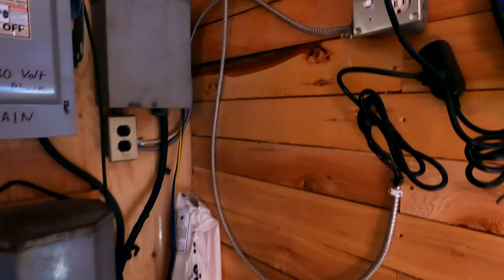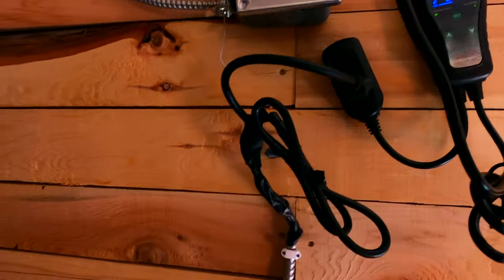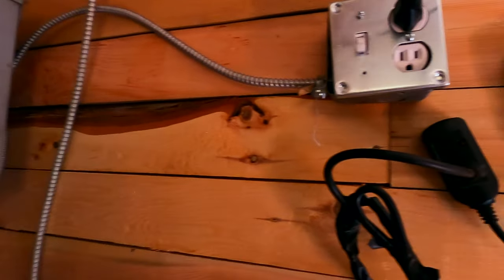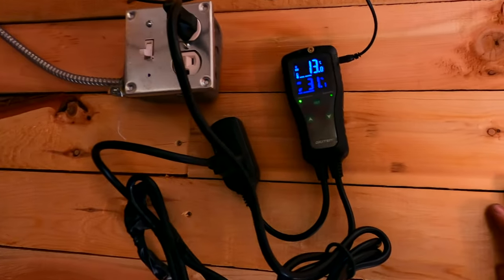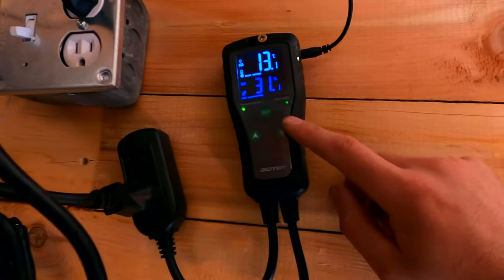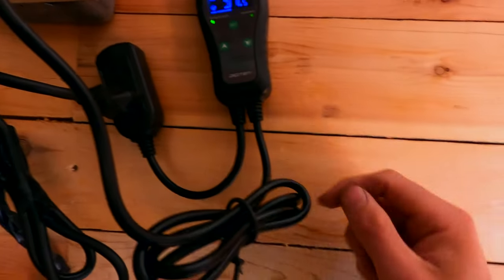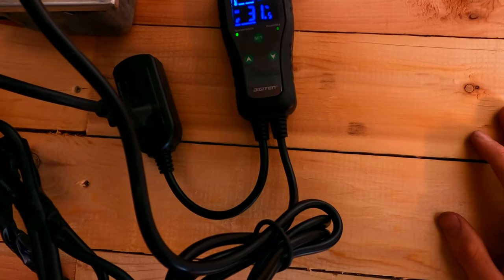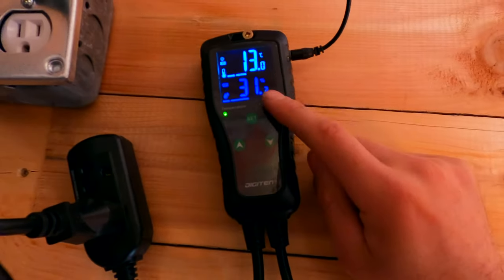I've been wiring away here for the last while. Because I'm prototyping, I've been doing things loosely — it's almost a good idea when prototyping to just hurry up and get it finished because you don't know for sure that it's going to work. I have here a humidistat that runs to a power controller, and I've wired in the humidity exhaust fan — a small one — and the flap that opens an air intake. Now I just have to figure out how to use this thing.